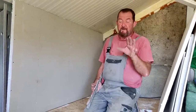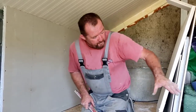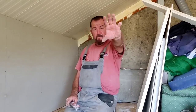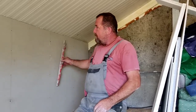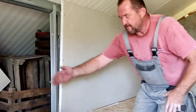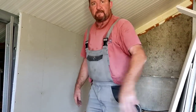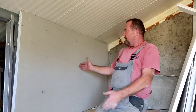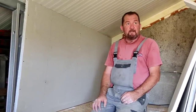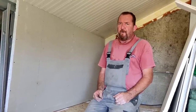Before I go for a swim, I'd just like to explain a little bit. When you're doing building jobs, plan it out. Think about where your furniture's going and stuff. Because we're going to have a double bed here, facing the windows, facing the views, yeah? This is a solid wall next to the bed, and the door for the storage space will be here, which is past the end of the bed. So you can open the door without it hitting the bed and being in the way. And if it's past the end of the bed, then when you bring stuff up the store, it's easy to get in and out. If I were to put the door here, you'd have to squeeze in beside the bed. Ridiculous. So what I'm saying is pre-planning everything: think about everything that's going to happen in the room before you start putting walls up in stupid places, which I have done before on many occasions.